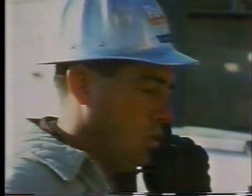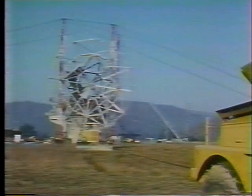Almost an entire second day was required to make the fits, engage the temporary turning gear with its pinion, enter the bolts into the declination bearing housings, and sledge up the hold-down nuts, which finally secured the superstructure in place. Because of limited and awkward working space, these operations continued to be directed from the ground.